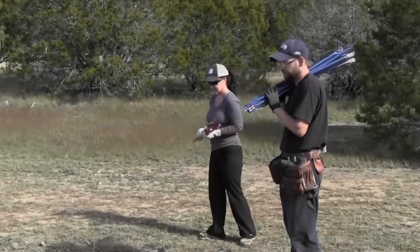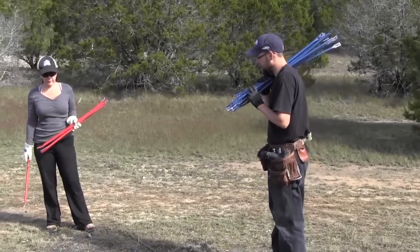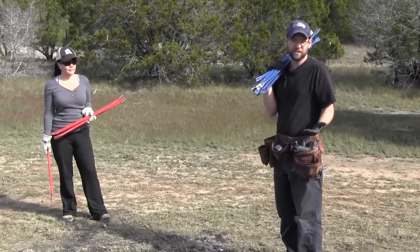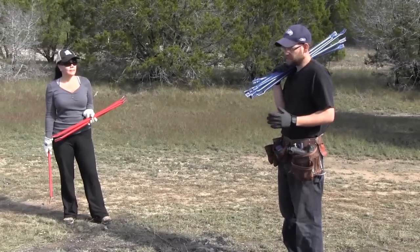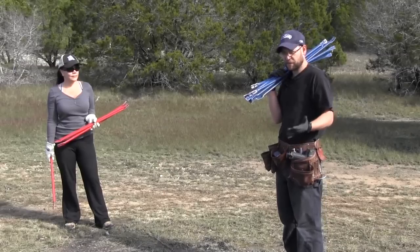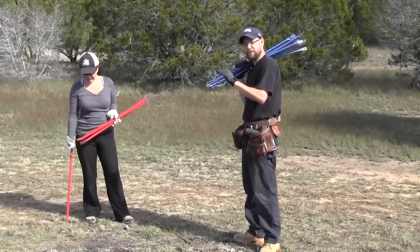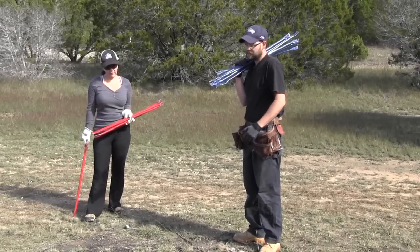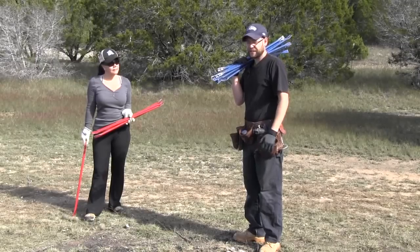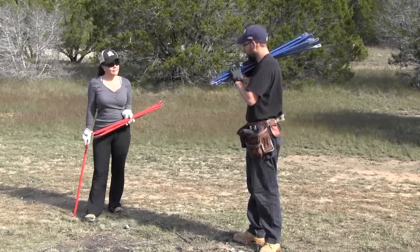Let's get building. The first thing you're going to want to do is have your parts in nice stacks so that you can keep everything organized. The second thing you're going to need is a little bit of wide-open space. It doesn't have to be flat — domes will rest on angled ground just fine — but the flatter the better; it's easier for working. So what we're going to do is lay out our pattern. This is a very important step. As you're following the picture guide, you're going to build the pattern on the ground flat. We're going to build this from the top down as opposed to the bottom up, because it gets a little heavy and we don't want to be doing a lot of work on ladders. Ladders are dangerous.